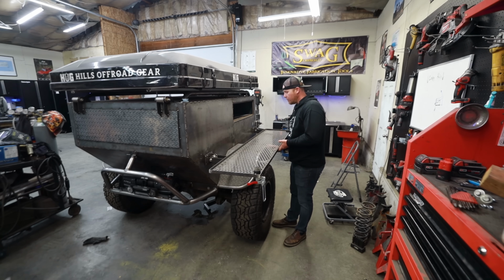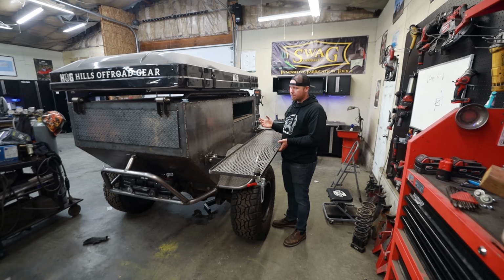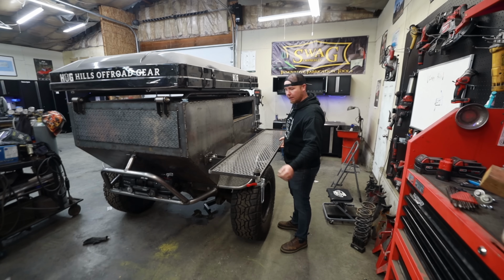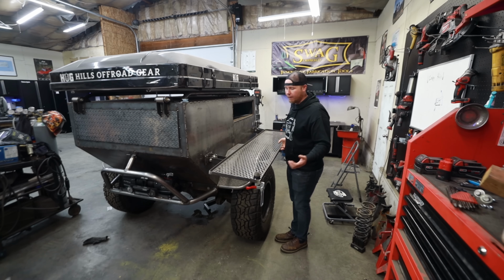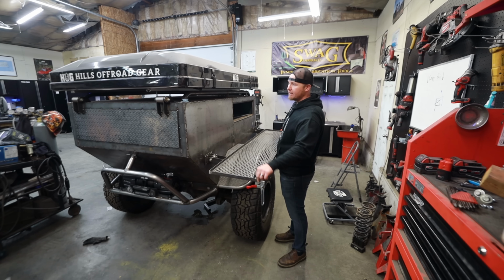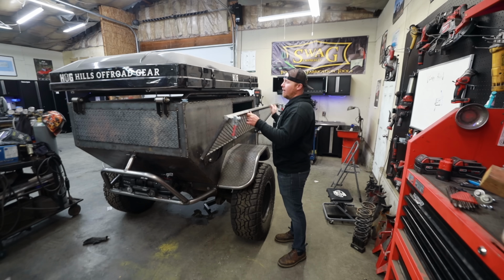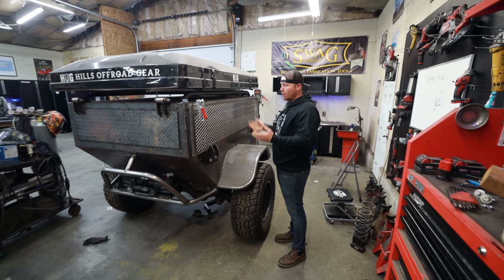So we could either just mount a bump stop here. Bump stop, super simple, extremely reliable. But having one resting point in the middle, I think is gonna make it a little bit flimsier than I would like. So the other option would be what I was originally gonna do, and that is cables. So put a cable from here to there, from there to there. And then that would be great. It would suspend, it would be a little bit more sturdy.